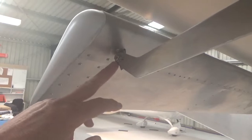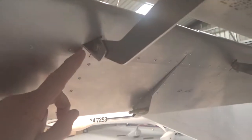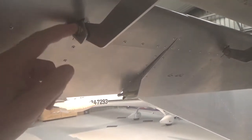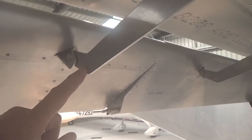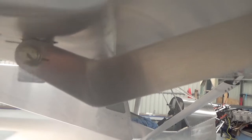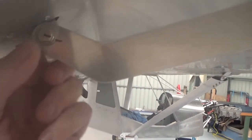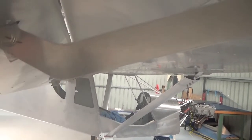Now with these hinge bolts, Viking Engines put out a video that explains it really well. The bolt needs to be tight — it gets tightened against the L-angle that comes out of the flapperon. So the bolt and the bush and everything is tight to this L-angle. The bush spins inside the arm. The arm has a quarter inch hole — check your plans — and a 3/16th hole in this guy. I marked out here, it's got a nylock on it, so it doesn't rotate in the sense that it follows the flapperon, but it does rotate with movement. You can't spin it by hand. The bolt and nut is tight, clamps down on the bush. A couple of washers either side of this stops all your play.